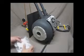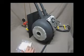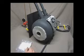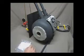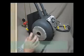Now, you'll see from the amount of K-wool that you have left, you'll be able to refit this firewall. For whatever reason you want to remove it, you're doing a large piece of Damascus, a large piece of forging, you want to forge four guys at the same forge, obviously two on that side, two on this side, then you'll remove this. There's enough K-wool here to refit the firewall to the chamber.